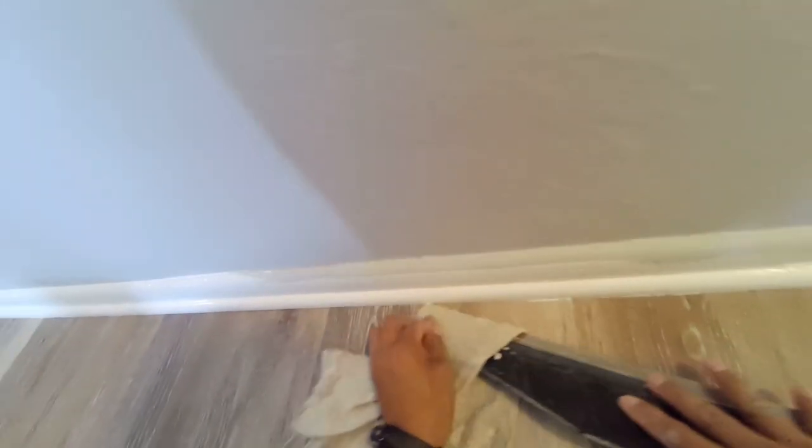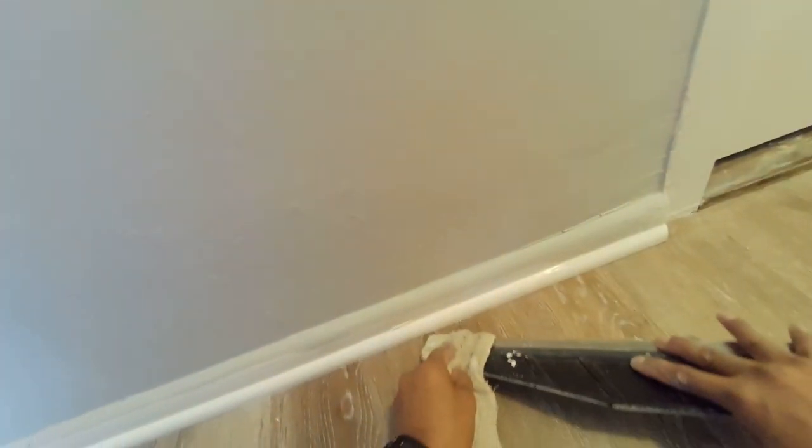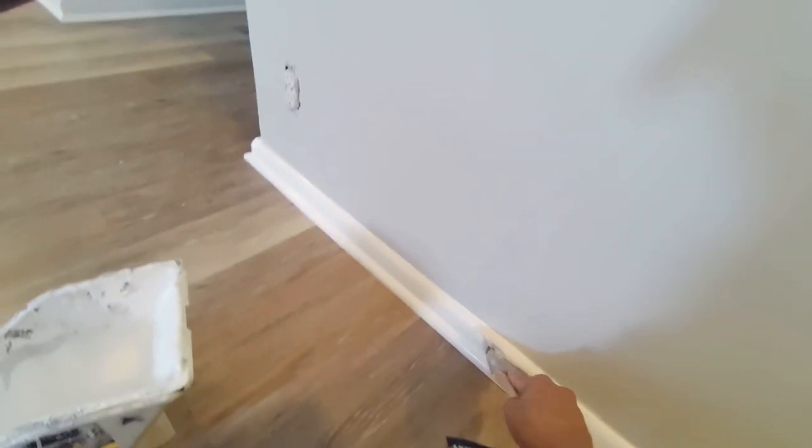So as you can see here, the paint went under the baseboard, but this baseboard is not straight, it's bent. And you can just put the rag over the paint shield and clean the edge. That's it. Just keep going like that. Center, bottom, and then the edge from the bottom, and then just finish on top with your own hand. Because the walls are not always straight, and you know the caulking is not always good.